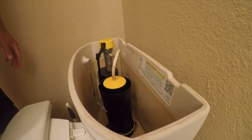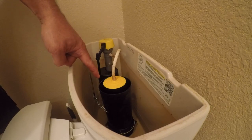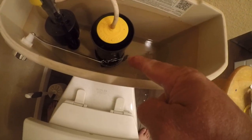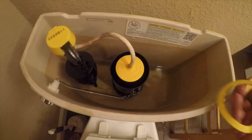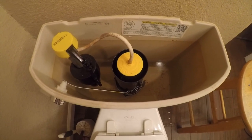This doesn't have to be a 30-minute video and you don't have to hear a dissertation about toilets. You don't have to replace all the other parts. There's a rubber valve under here — if you have debris in the water, stuff can get stuck under there and that's easy to fix too. But that's how you replace the cartridge seal at the bottom. I hope you found that easy and simple — good luck. I'll put a link to that part on Amazon in my video.